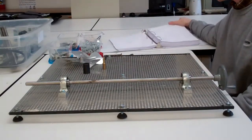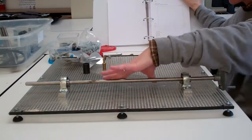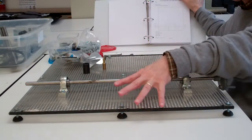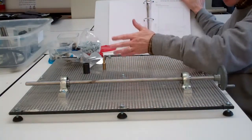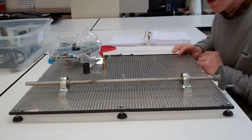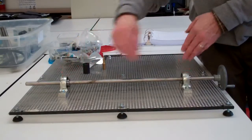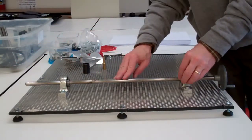On page 81 there's guidance for how far the bearings are apart and how far the shaft is from the end of the board — those are just rough guidelines. Five or six inches from the edge of the board is good because we'll use this setup again next week to mount an additional shaft with a belt. It's probably better to space the bearings more than 10 inches apart to provide support near the crank handle and near the fan.